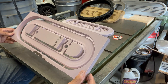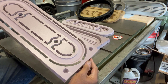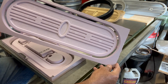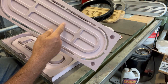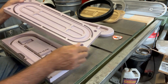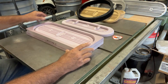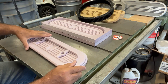I've got another video on foam pattern materials if you're interested. Here's the base, and you can see the filter gland on this side here. And then the lid, which you can see the ornamental features on the lid - holding tabs around the perimeter, and some reliefs in the interior and the filter gland around the perimeter of the part. So I just take a razor knife and cut the tabs and cut them out of there. And then I do sand the patterns a little bit. Here's a couple of the patterns that I've rubbed with 220-grit sandpaper.